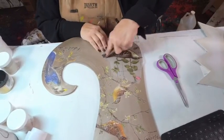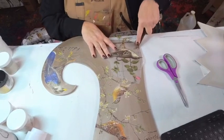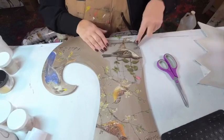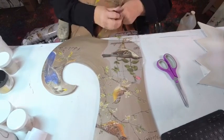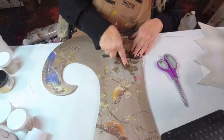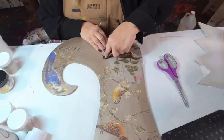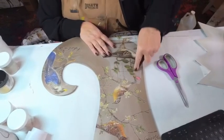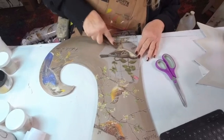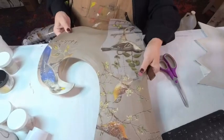I'm not sure I can promise these are exterior rated, but I'd still hang it on my front door. I'm putting a top coat with UVLs — a UV protectant — from Faux Effects, though that is a special order product we don't keep in stock. If you want a top coat with UV protectant, let me know and I'll bring some in. Just understand — just because a top coat is exterior rated doesn't mean it has UV protectant for anything under it; that's not the same thing.